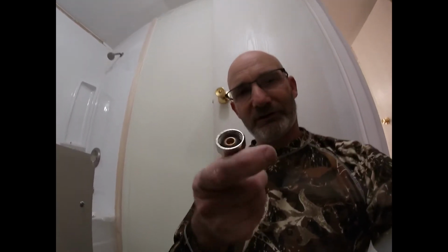So anyway, here we go. I'm just going to get you set up and watch it. I will probably just speed this up some. All you're going to do is hook this up to the bottom of the faucet. The 1/2 inch end, the 3/8 end, you're going to hook up to your shutoff valves. Again, in the application that I have, you want to hook them up and hand tighten them, turn them about 1/4 of a turn, and all that should go good.